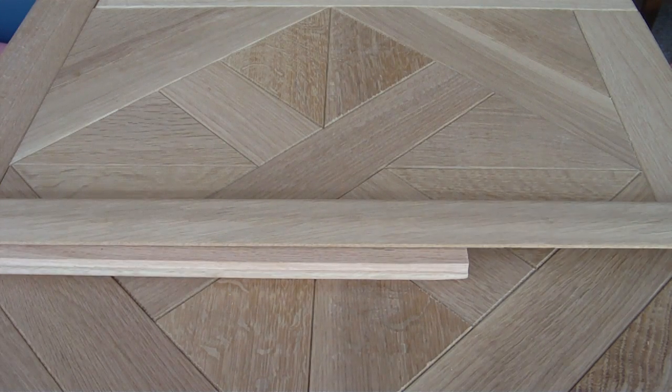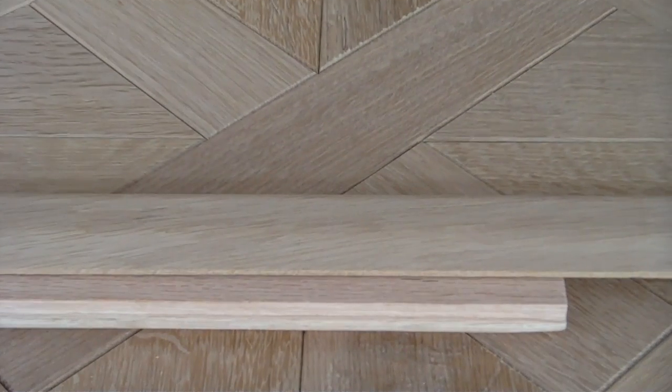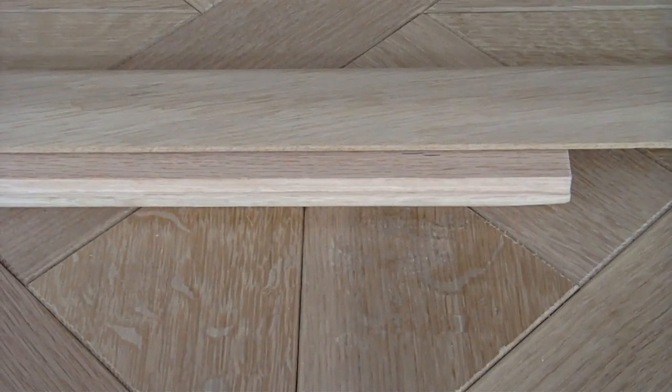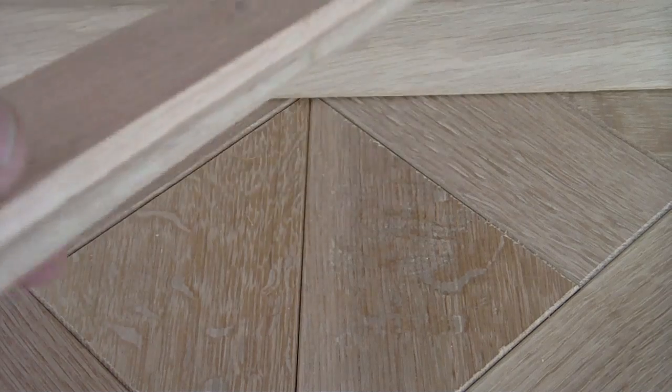You can see just in the color difference that one is red oak and one is white oak. But I can assure you that can be very deceiving, because red oak varies greatly depending on from what region it was harvested — be it the Ozarks, the Appalachians, Michigan, or Canada. So it's always safer to go a little deeper in our study of a board.